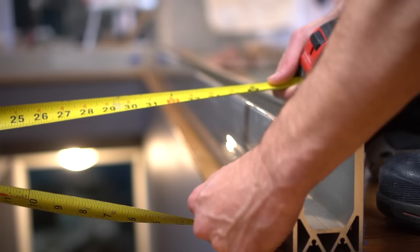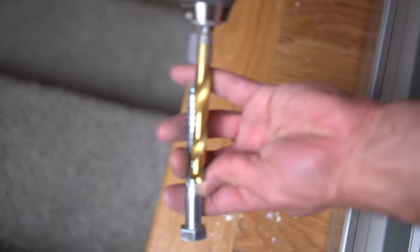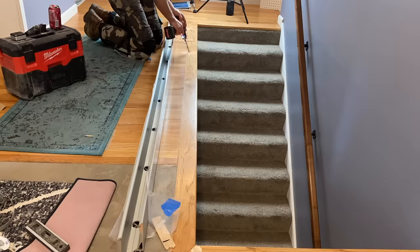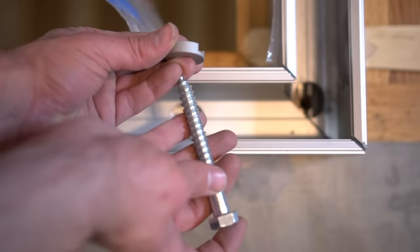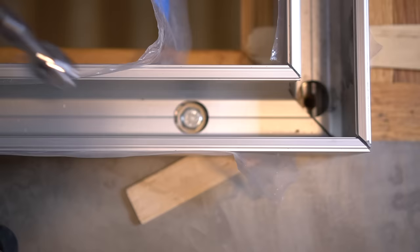I take a quick measurement at all ends just to ensure we have the proper spacing between the base rail and the end of the flooring. At this point, we know exactly where the base rail is going to be placed, and therefore I can mark my hole locations for each penetration. The kit comes with very large lag screws, and when you're pre-drilling, just make sure you're using the correct drill bit — it should be slightly smaller than the lag screw. Once I pre-drill all my holes, go back over each hole with a vacuum to remove debris. This kit also comes with custom designed washers to ensure maximum supportive strength on the bottom of the rail once you lock these lag screws in tight.